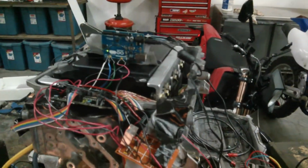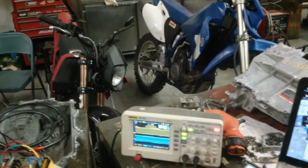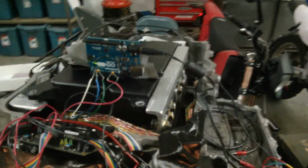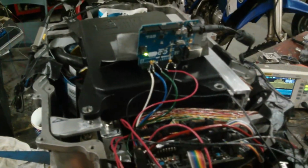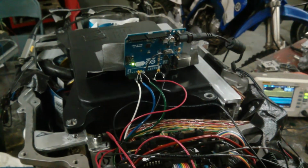Okay, so just do some testing on my do-it-yourself leaf controller here. Basically, I had something tripping out my desaturation detection. What I boiled it down to was some ringing. Basically, when the low side IGBT was trying to turn on really fast, it would actually ring a bit.